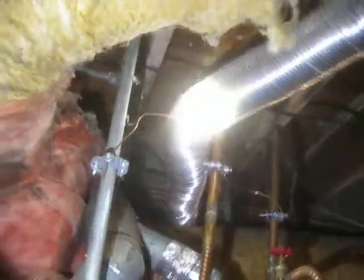This is a real fire concern. The four-inch single-wall metal is actually the appropriate type of dryer vent pipe, but this fitting here has caused a clog which could easily lead to a fire. Good thing they caught this — though it's not entirely clear what's been done about it.